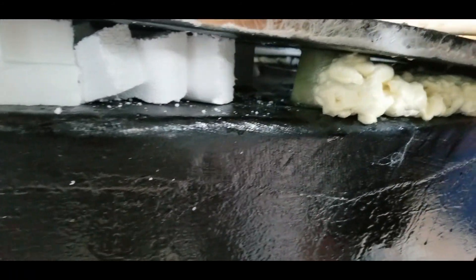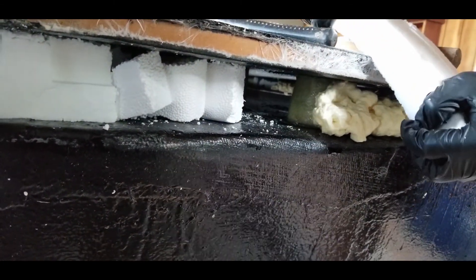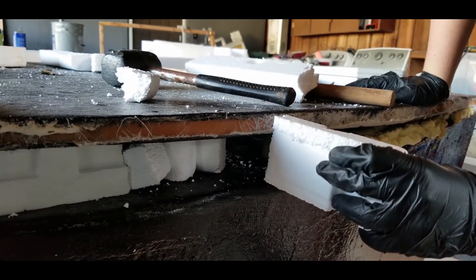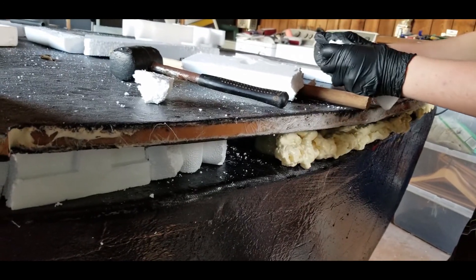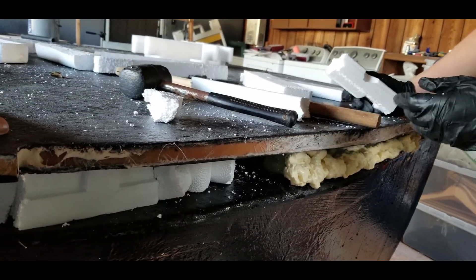You can see the little fiberglass puck supports that provide structural support between the top of the pontoons and the bottom of the deck panels. We're just filling it in with styrofoam and then the spray foam, and then coming back and coving it in a little bit and then adding a layer of the fix-it-all, which is absolutely resistant to the fiberglass resin.